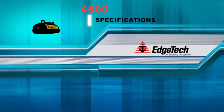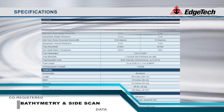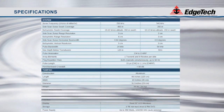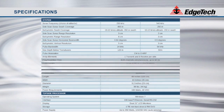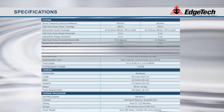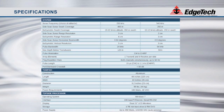Moving to the 4600 specifications, the system operates with both CW and chirp pulses to maximize performance in all operating conditions. Cross-track resolution is up to three centimeters with a ping rate of up to 30 hertz. Vertical resolution is specified at five centimeters. The system is available in two frequencies: the 230 kilohertz offers deeper water operations down to 120 meters for the pole-mounted system, while the 540 kilohertz offers even higher resolution but is recommended for water depths not exceeding 50 meters. At 10 to 12 times the water depth, the bathymetric coverage swath is 350 meters for the 230 kilohertz system and 150 meters for the 540 kilohertz system. Side-scan swath coverage is 450 meters and 250 meters respectively. Side-scan sonar range resolution is an impressive 2 centimeters for the 540 kilohertz system.